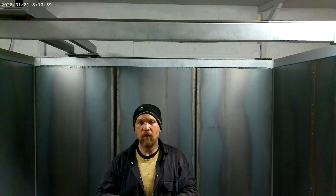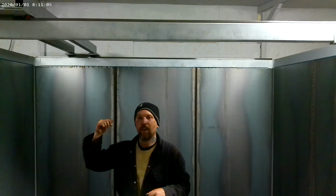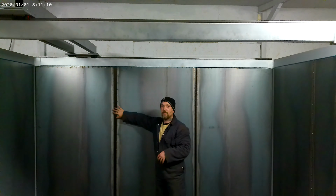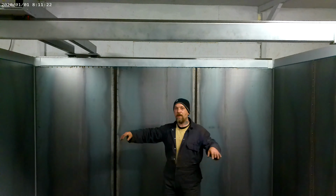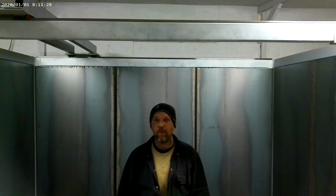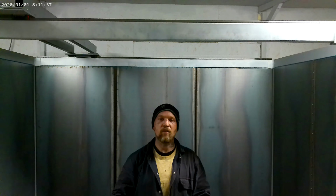For them on the JMC servos, they're going to be running my Y gantry, my X gantry, obviously, my telescopic Z. And then at the back here, you'll see I have a couple of slits here, a separate set of lights coming up and down. Run about 16 of them at 200 watts. They'll tally up, and that'll carry on at a set height from the Z on the telescopic arm, just to keep the top layer of the material nice and warm.